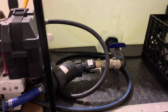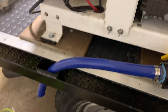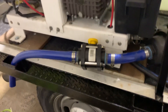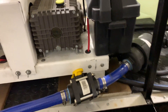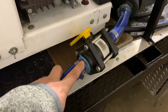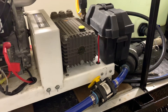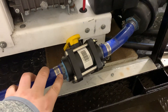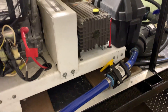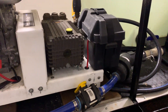Here we have our one-and-a-half-inch line coming out of our actual water tank, and here is our one-inch ball valve — that's our dump valve — so if we need to wash our hands or need to dump the tank before we drive anywhere, it's all good to go. It's all plumbed up, and as you can see here we use what we like to call the blue goop. That blue goop is a lifesaver — if you're doing any PVC work we highly recommend it because it holds like a beast and there's a reason why some of the top names in the industry use it.